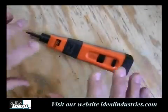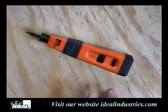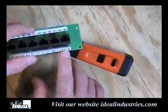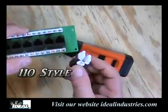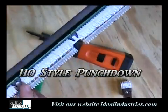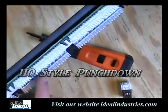Now, when you look at what the tool terminates, it'll terminate basic connections like these connections here, which are also referred to as 110 style. On a category jack like this, those are considered 110. And on a patch block like this here, these are also considered 110 style.